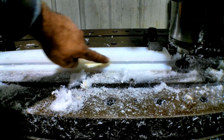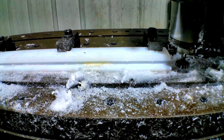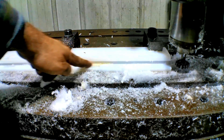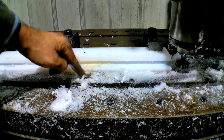Right here, this yellowing — that's burning. That was burnt. That's where I had to change my speed; I was cutting too fast, too much spindle speed. So what we're going to do is drop this back down and run one more pass over this just to clean that up. Hopefully that will take care of that spot.